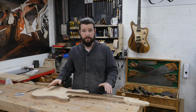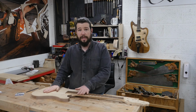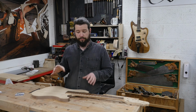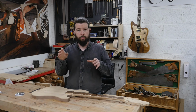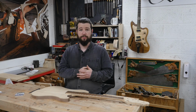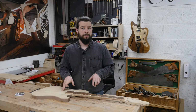We do not want to set it to 12 millimeters, which is our measured height, because then the saddle will be slammed down, and if there is any error or any wiggle room needed, we don't have it. So remember that number, 13.5 millimeters. It's the number we're going to use, and when I reference it, I want you guys to know where I've pulled it from. It's essentially height of the bridge plus 1.5 millimeters for adjustment. That's it. Now we need to figure out, based on that bridge height, do we need a neck angle?